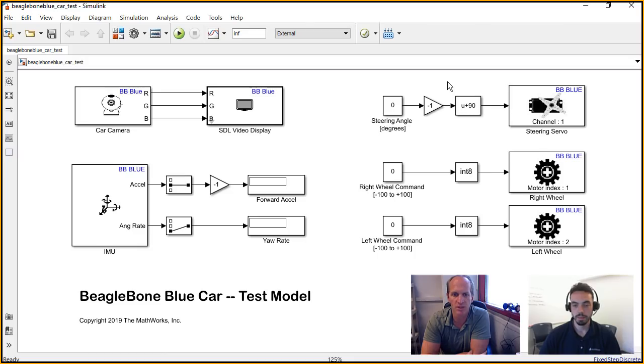You can change parameters and view the results on a scope or a display while the actual code is running on the BeagleBone Blue. One thing that's great about Simulink is that it's graphical. I learned controls in Simulink originally, and so it made a lot of sense to me. Diving into C code can be overwhelming, so Simulink is great for that. The BeagleBone Blue support package is really fantastic because it does all that communication to hardware for you. Ultimately you just have a block on your screen that says output to motor or IMU, and you get the data and it works — you're not bogged down with software and hardware, and you can go straight to learning the controls.